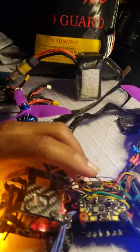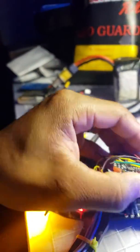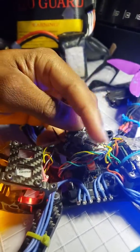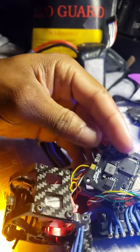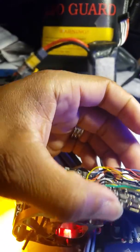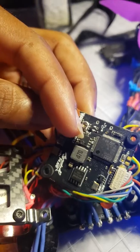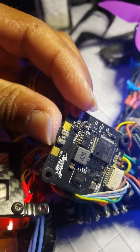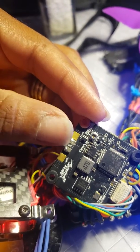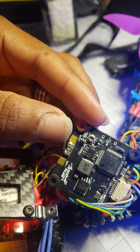I have voltage to my ESCs underneath, and my ESCs are directly connected to the FC via this cable, which I have plugged and unplugged several times. I did notice on the FC right there's like a burn spot where it looks like it just overheated.